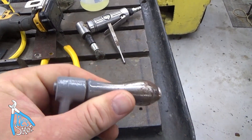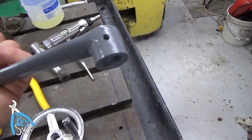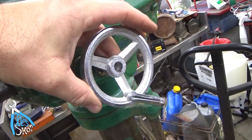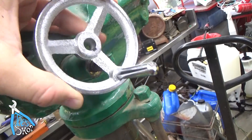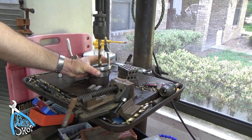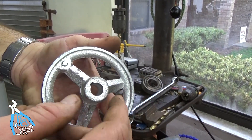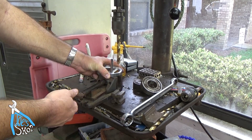I went through and remade this handle. I only painted part of it — I'll put some furniture wax on the handle to keep it from rusting. I'm going to paint that gray. The other handle here was snapped off right here. What I need to do is take this hole, which is roughly 12 millimeters, and drill it out to half inch, which is about 13 millimeters. Then drill a hole in it and put a roll pin of some sort in there, and then this will be my hand wheel for that. The material's a little harder than I thought, so I ground a flat on here so I can hold it with a vise, and hopefully we can get through that. That should also be a good spot to drill in the roll pin.